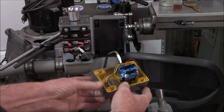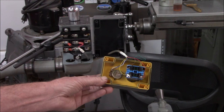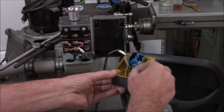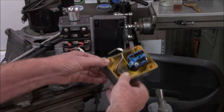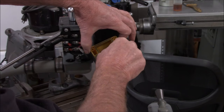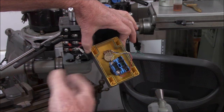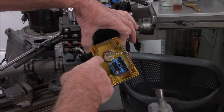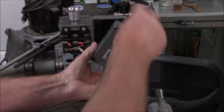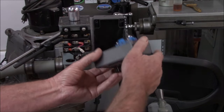Let's take a look at the drawing. Before we go there, one note on the potentiometer: this is a 5,000 ohm or 5K potentiometer, which is probably the most common. You could probably use a 10K, but 5K is usually the best. Your center terminal - the white wire - that's going to be your speed reference. The outer two terminals are your voltage source: one negative, one positive. Depending on your potentiometer you may have to flip-flop those outer two so that clockwise is faster and counterclockwise is slower - I had it backwards the first time and had to switch them.